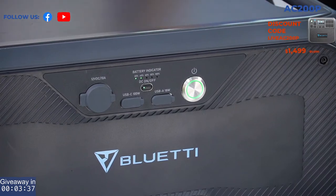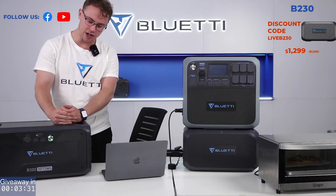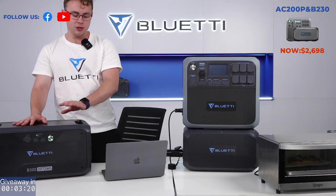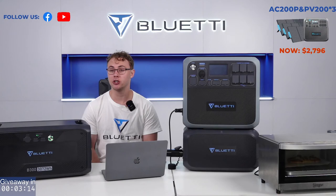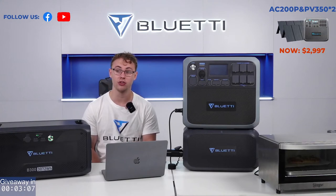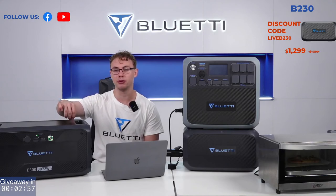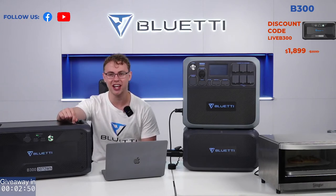So what else can we say about our B300 battery? B300 is originally made for AC300, but it also can be used with other power stations of ours. Speaking about recharging B300, we can do it different ways. Number one is from AC input, with a maximum input of 500 watts. Number two is from solar input, 200 watts maximum, and the open circuit voltage is from 12 to 60 volts. Number three is from car input, either 12 or 24 volts from the cigarette lighter. With AC adapter plus solar, you will get the maximum input of 700 watts. Okay, this is about recharging our B300.